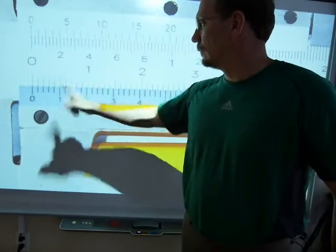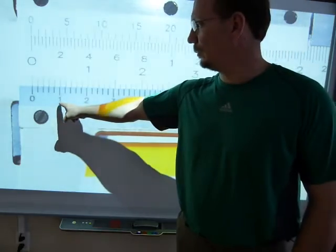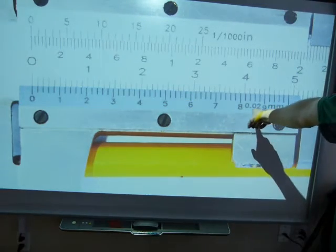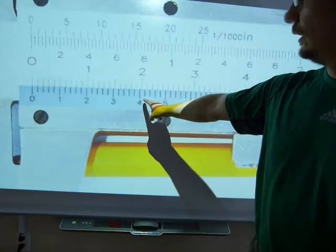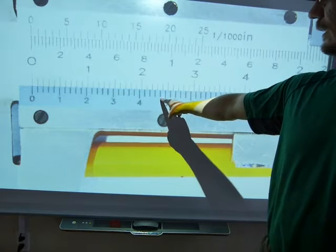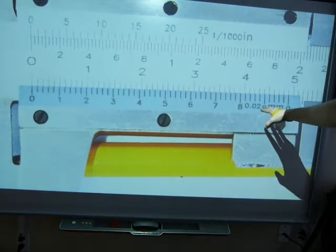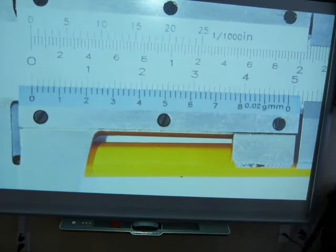So the numbers read: that's one tenth of a millimeter, so that's 0.1, 0.2, 0.3, 0.4, 0.5. And to make it work with that number there: 0.40, 0.42, 0.44, 0.46, 0.48, 0.50, 0.52. That's what's meant by the 0.02 — every increment is two hundredths of a millimeter.